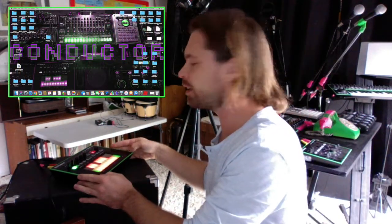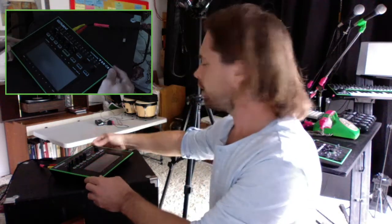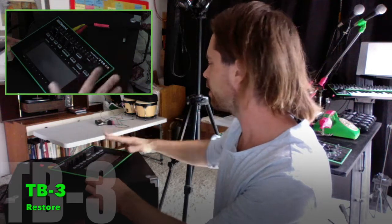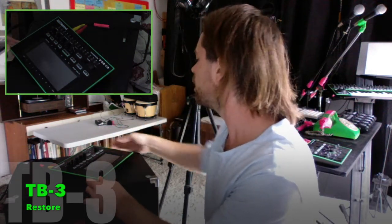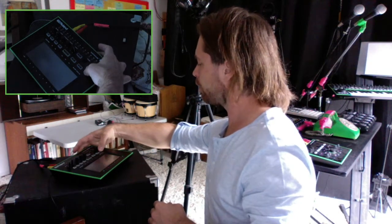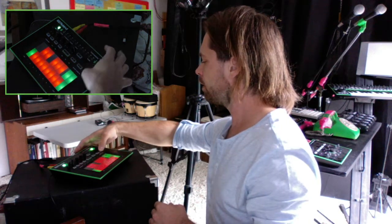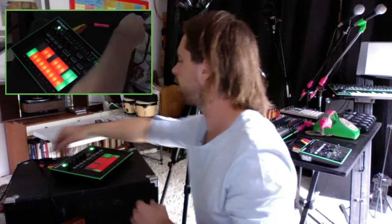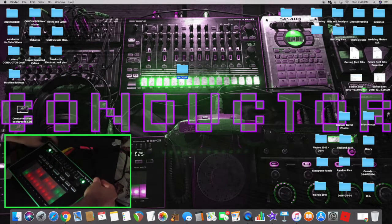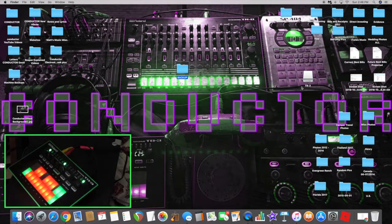You can't tell just by looking here, but you can go back to your computer and you've got this backup file — you can open it up and there are all the files we've just backed up. Next, I'm going to show you how to do something similar, which is restore files that you've backed up in case you need to add them back into the TB3. Same steps as before — hold the Play/Stop button and turn the power on. Again, you can see the light dimming up and down, so we plug in the USB.